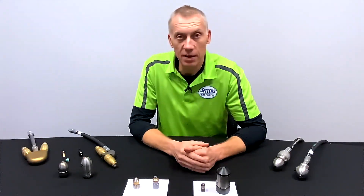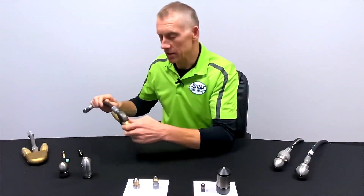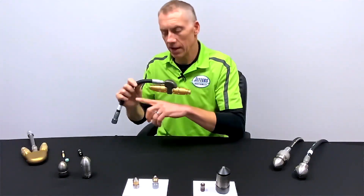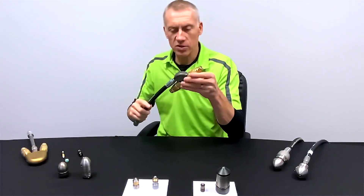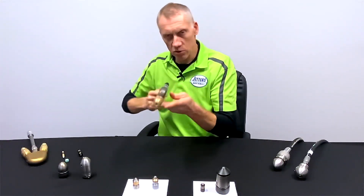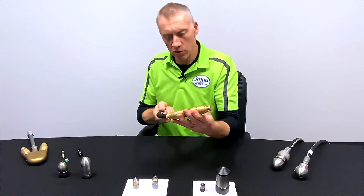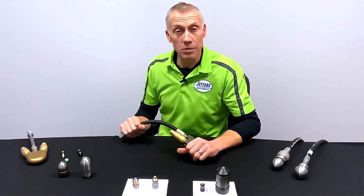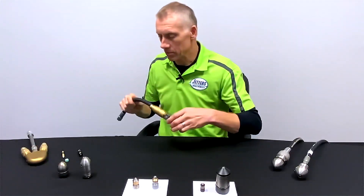Now, among these internal rotation nozzles, there are a couple of oddballs worth covering. The Root Ranger series has been out for quite a while. This particular one is a double Root Ranger — a coring cone jet out the front and a coring cone jet out the back, making it pretty long. With Root Rangers, the hose comes in from the side, so it's not necessarily centering itself — you might have to loop your hose and twist it for full pipe coverage. One funny trick: you can sometimes aim them around a corner. For jetters that do four or five gallons a minute, it may be the only root cutter option. It's slow going, but if you can punch through a mass, the back jet can do some cutting for you.